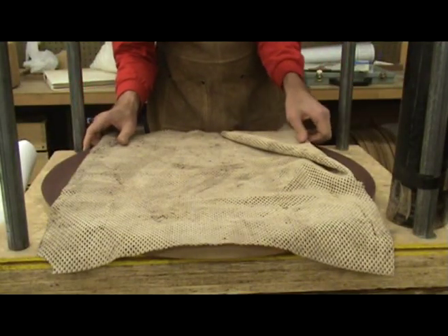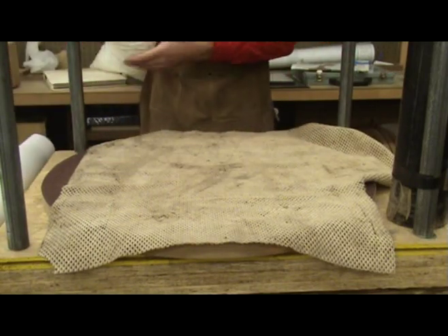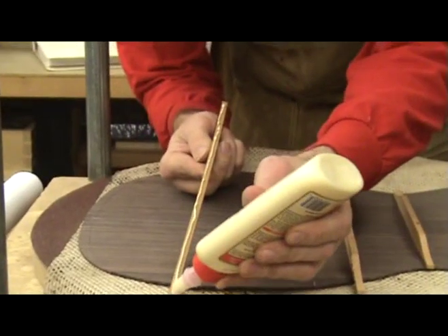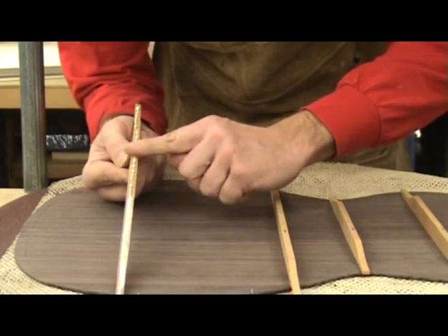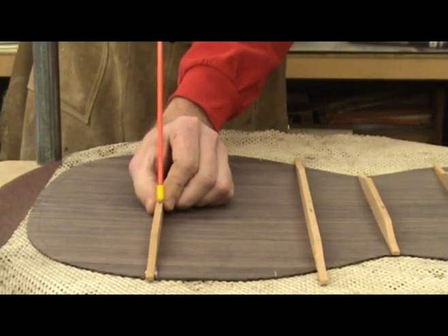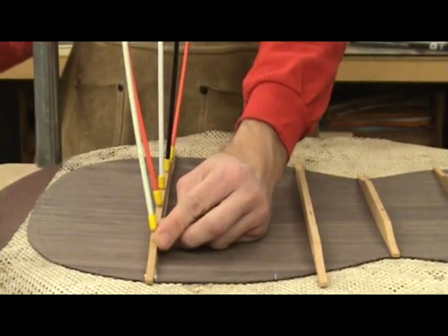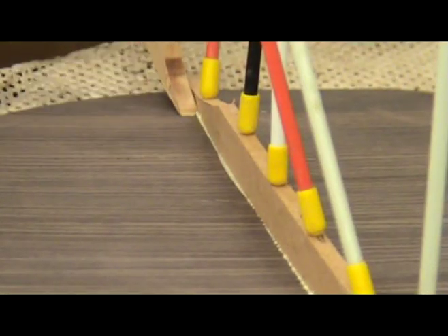I will be gluing the braces in my 15-foot radius dish using the go bar method. I have found that placing a thin flexible material like a router pad in the dish and under the back gives a better glue joint. I apply the glue sparingly to the brace and spread it, then very carefully place it in position and use one of the fiberglass go bars to apply downward pressure. Be careful as the brace will want to skate out of position as you apply pressure. Continue putting on fiberglass rods until the brace is completely clamped — usually about 6 rods per brace is sufficient. A piece of scrap wood with an edge works well for cleaning up excess glue along the brace.